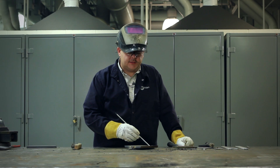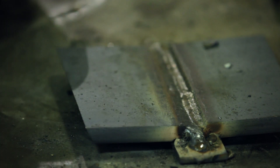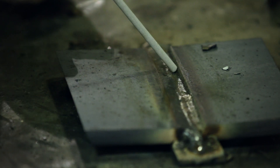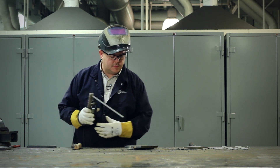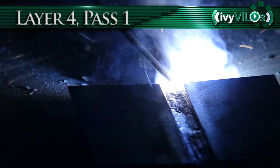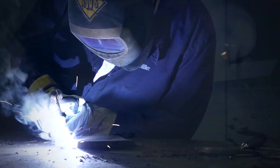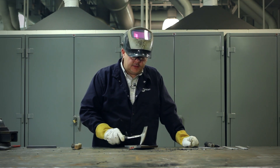At this point you see a small edge right here and it's about an eighth inch high. What we're going to do with the first pass of our fourth layer is aim our electrode at that piece, but go at a speed that's just fast enough that we don't burn over that edge. That edge is going to be used as a guide to make your first pass of your cover pass. Once you remove the slag from this weld, the top edge of the plate should be left unwelded.